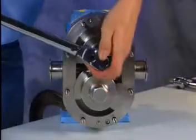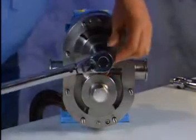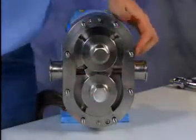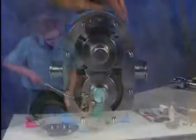Use a rotor nut wrench or socket to locate the rotors perpendicular to each other. The rotor timing should now be checked. Clearances on both sides, wingtip to wingtip, must visually be equal.